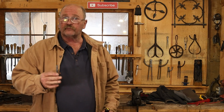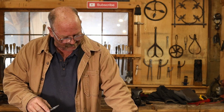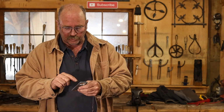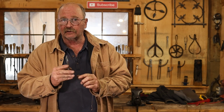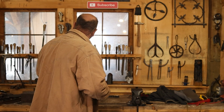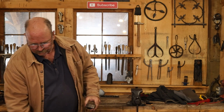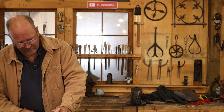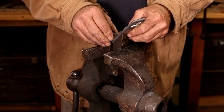That's pretty much what I want for those three edges, but I need something that's going to grab the bottle top, and that isn't going to do it the way it is. But instead of the usual little tab that I push out on a bottle opener, I'm going to just file a nice crisp bevel that comes kind of to a sharp edge there, and I think that will do the trick. The filing vise should be the ideal tool for this.